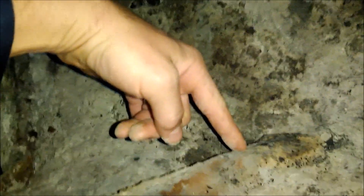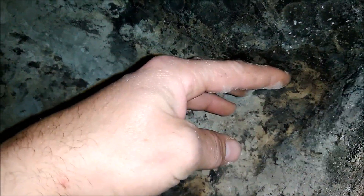Today what I have to do is replace these air pipes — I'm going to make them out of stainless. But I have one issue: I can't get back down in here. This is all casted refractory work — very dense material, it's got needles in it, very hard to break up. So I'm going to cut it there, plug it off, cut it back here, plug it off, drill a hole in the side back over here, come in with a port that runs right along the side, blow the air down, come in on the other side and sweep it also. They're going to be pipe on both sides.